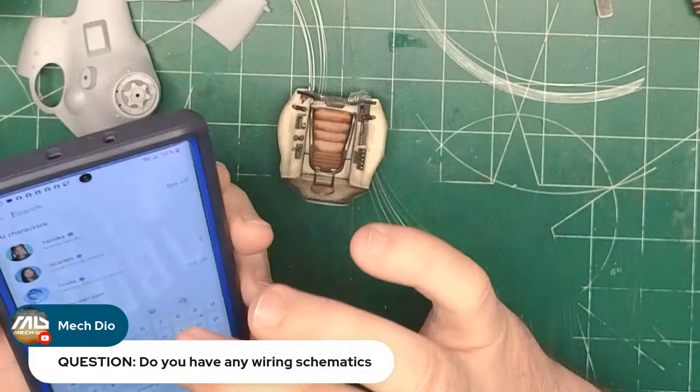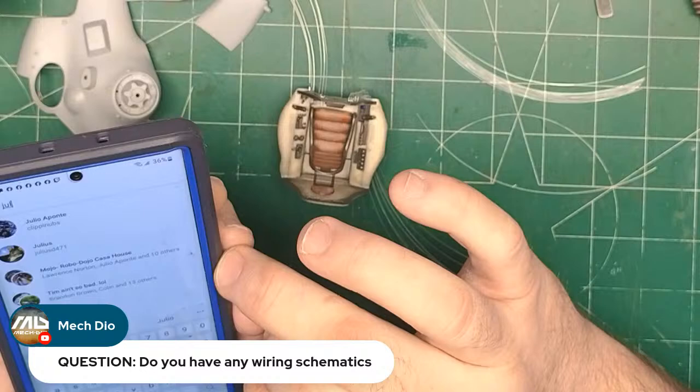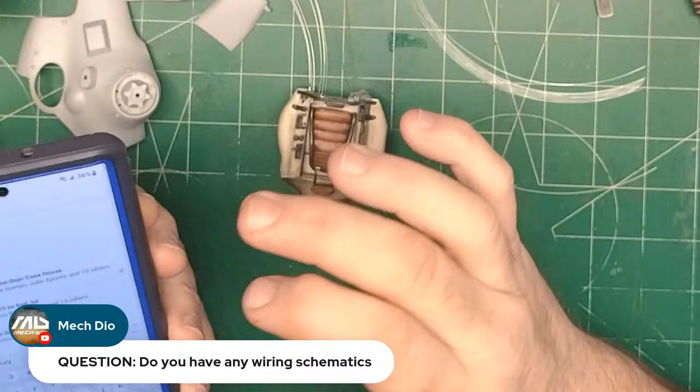There you are. Julius 471. Is that correct? By the way, LED, light emitting diode. Yes. So in the op, diode voltage is the voltage spec for the particular LED? Yes, that is going to be either around 3 to 3.2 volts, or if you're using red LEDs, maybe 2.2 to 2.3. They use a really low voltage for red. Everything else typically runs on 3. Even if it says it'll run on 3.2, it'll run on 3 just fine.